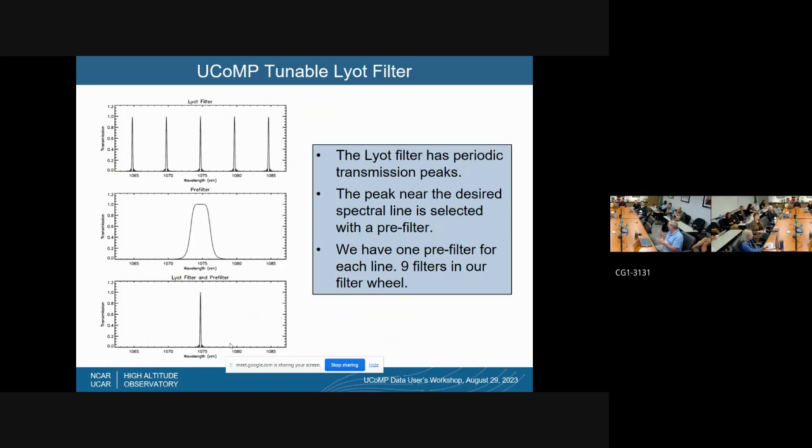And as people have mined it over the years, there's less and less calcite available. Lithium niobate has half the birefringence of calcite, so you need to have twice as thick crystals to do the same thing, which is fine. But people can grow it in very large sizes in a laboratory environment. So if you want to have a large filter, which you need to couple to a large telescope like the Cosmo Large Coronagraph, you need large crystals, and that's why we shifted from calcite we've used in the past to lithium niobate to have larger crystals.